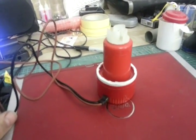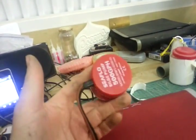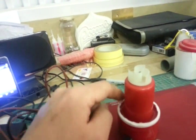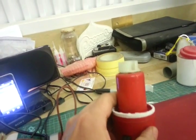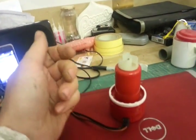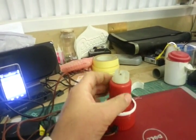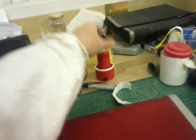Here's another part of the ROV — the drive motors, or thrust motors. These are bilge pumps, and because they're already waterproof, what you do is literally cut off some of the housing of the original bilge pump. You can remove the impeller and place on a propeller instead. They're good pumps — it saves you waterproofing anything since that's already been sorted. Plenty of other people are using these on home-build ROVs, so I thought I'd give them a go.